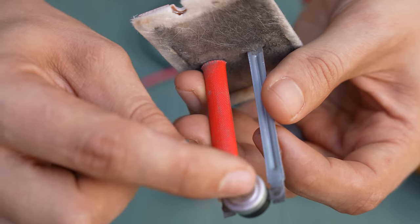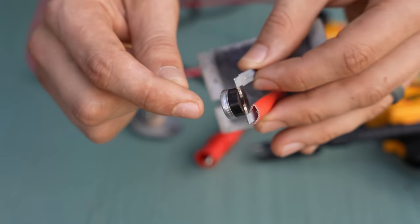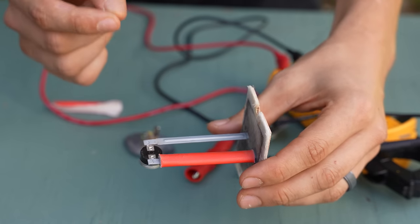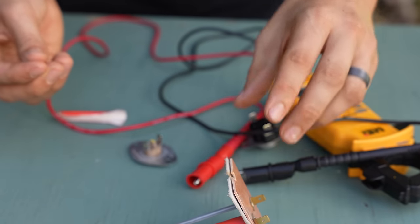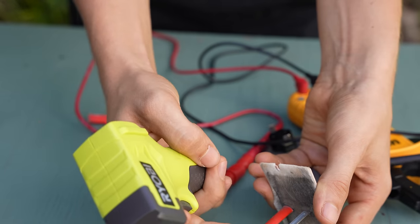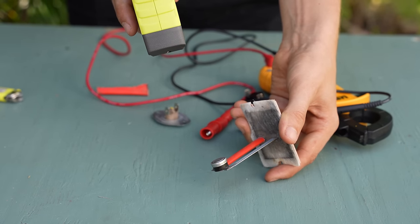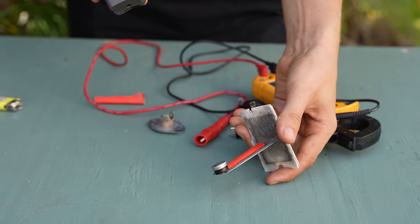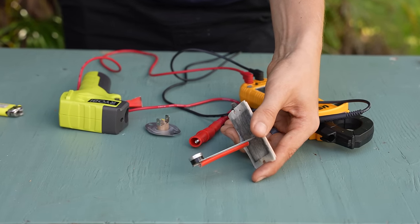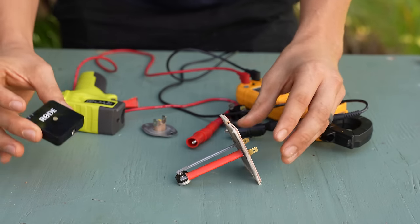There's basically a little metal snap disc inside of here. Once it heats up, it warps and kind of pops out, which triggers a little micro switch inside. When we take it apart, hopefully we'll be able to see that. So what I'm going to do is roast this until it trips — that's when the beep should stop. Then hopefully I'll have enough time to use my temp gun and see what temperature we're registering. It does cool off really fast, but we'll also be able to tell when it resets automatically because the meter should start beeping again. You can hear a little snap when it trips and when it resets, so I'm going to put my microphone right next to it as well. Let's give this a try.